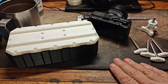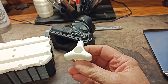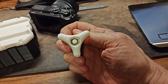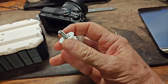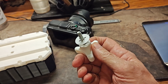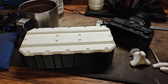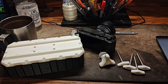To hold the camera on, I went on Thingiverse into their configurator for this — I'll put a link below — and I modified it to fit a quarter-20 bolt with a six-point hex on the bottom. I made a little keeper washer so when I unscrew it, it won't drop out and bounce. I made it large enough so even fumble fingers like me hopefully won't drop it, and if I do, it's big enough I won't lose it.